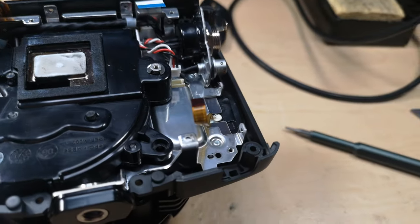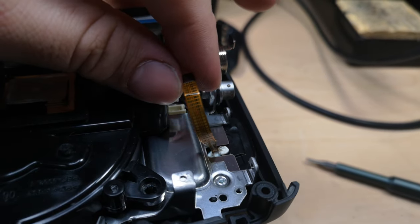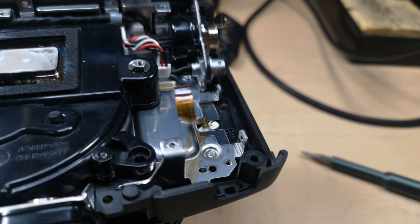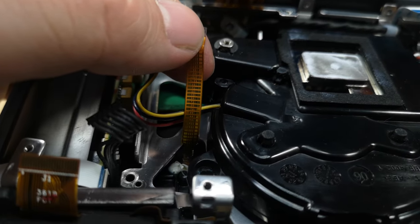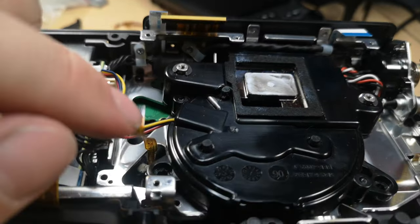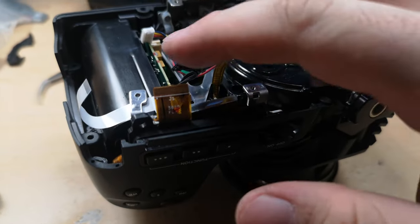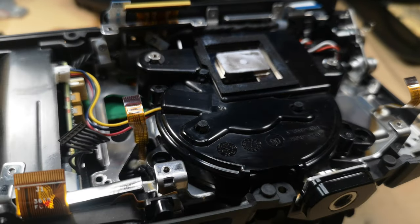Sorry, just realized something while poking around at this some more. All those little horizontal lines there. I was like, oh, maybe they added a little more copper onto the flex PCB for like a reinforcement or something. No, that's shielding. So that little grid pattern you see horizontally across the middle three connectors, or the middle three lines, that must be EMI shielding to stop the mics from picking up noise. That's really cool. I haven't seen that before on a flex PCB design. Usually it's just all sort of solid, so very neat.